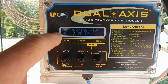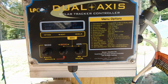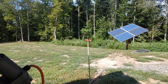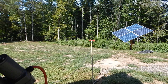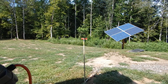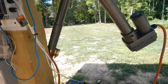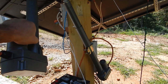The screen is telling me I have my high wind speed parking set at 25 miles per hour. I have the anemometer out on the ground on an old rake handle — we don't get a lot of wind here. I'm doing this by myself, so I'm going to use my little Ryobi blower to get that thing spinning. I'll set up a camera so you can see what this is doing and watch the solar tracker go through its paces via these two actuators.